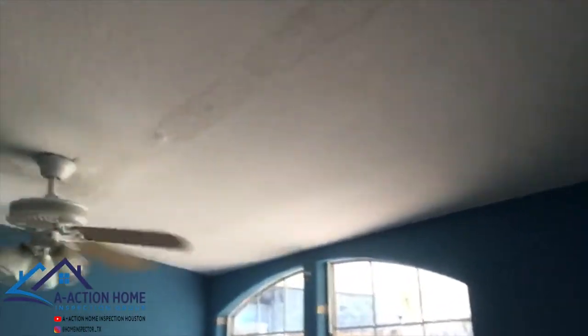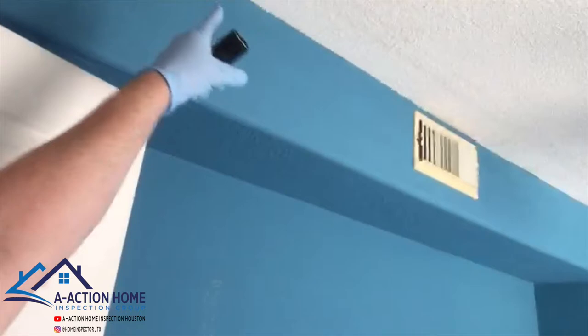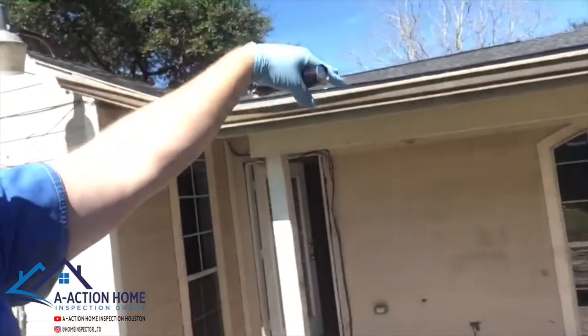On my initial walkthrough, I saw some nice water stains up here on the ceiling. We've got some mold-like substance building up right there. So then when I went up to the roof, it turns out this roof is flat, and on this flat roof they put shingles that are designed to have a pitch. If you don't have a pitch, it's gonna catch water. And this water is not pooling up anymore — it's leaking straight through into this sunroom here.